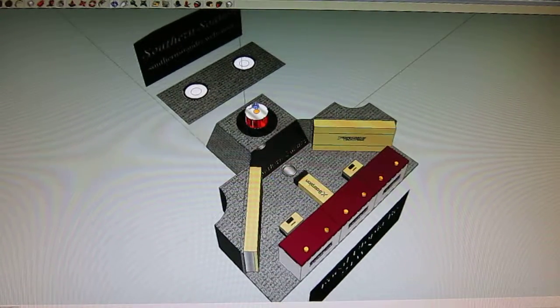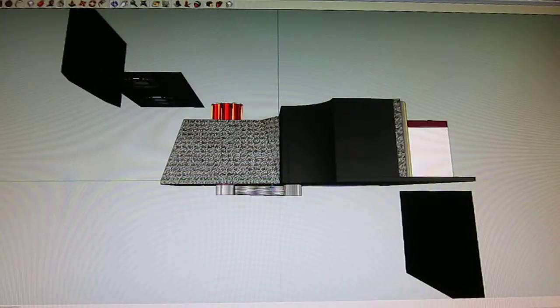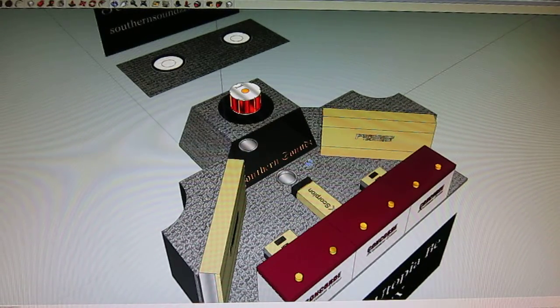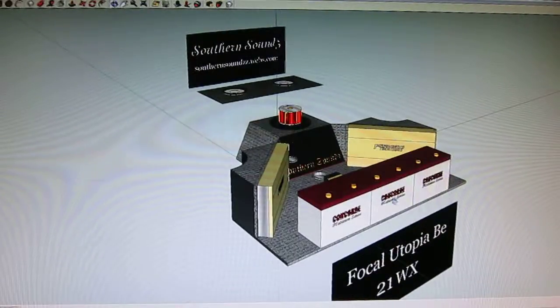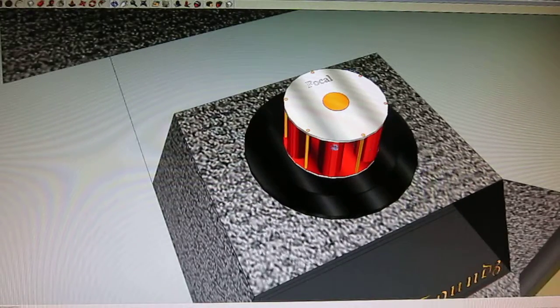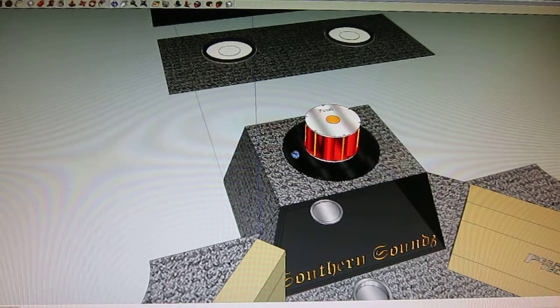The port they call for on here is, I think they said, yeah, 2x5 1/4. So me extending it at this point, of course, to keep the box tuned the same, you would have to make the port slightly larger. So I went, just ballpark figure, like 3x10. They have it tuned to 34 hertz is what this calls for, which is literally perfect for an 8-inch subwoofer. I mean, just 32 hertz, 33, 34.